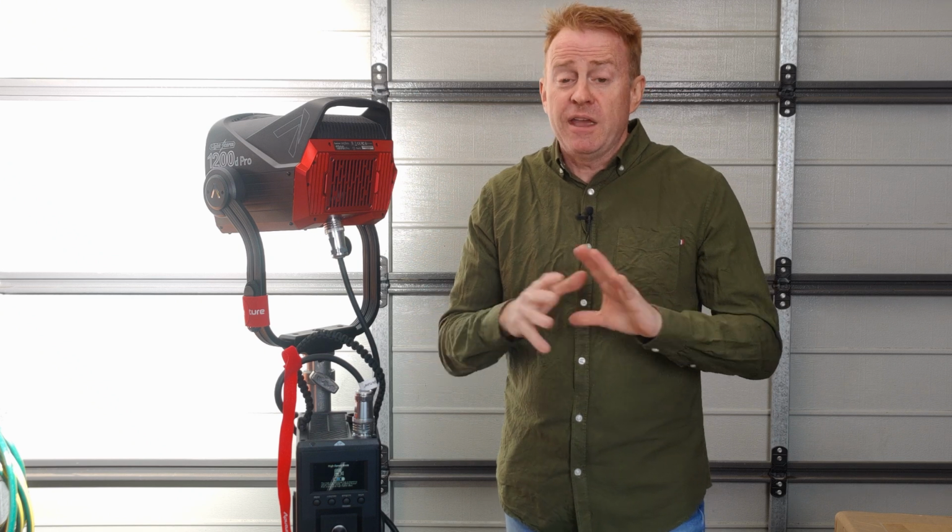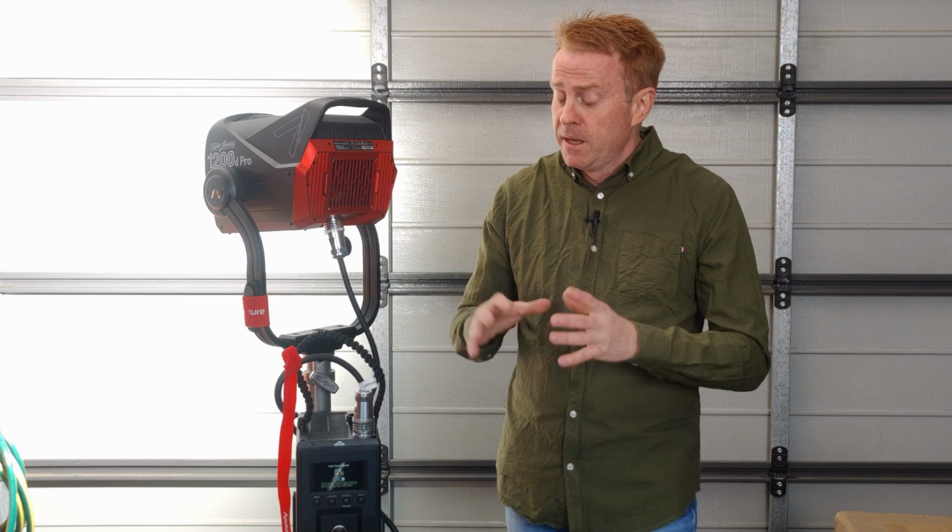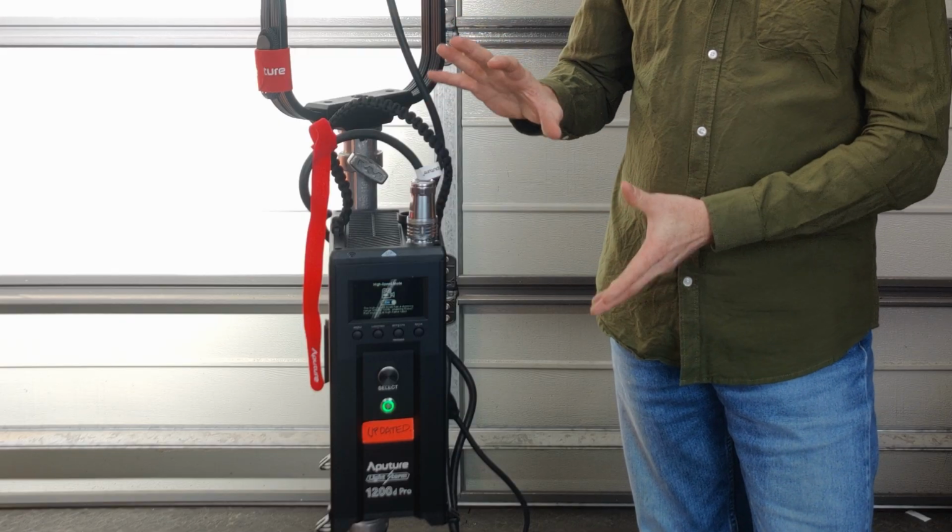5.7 years. Now, can you imagine if every manufacturer of lights, every step along the way in the evolution, waited 5.7 years to thoroughly test their lights before releasing it? We would probably only just be getting into RGB lights now. All right, so the best insurance policy that manufacturers have to cover themselves if anything goes wrong with the light into the future, because they can't test them for 5.7 years, is to put backup and redundancy hardware into the lights and have that be able to turn on with a firmware adjustment.